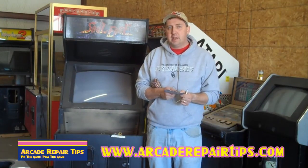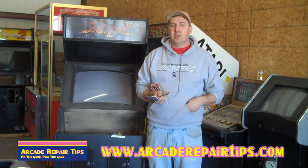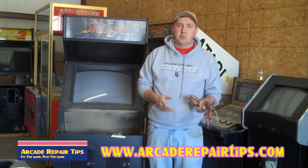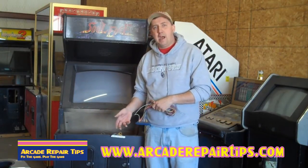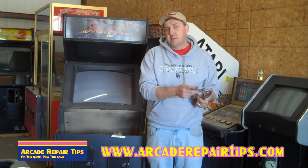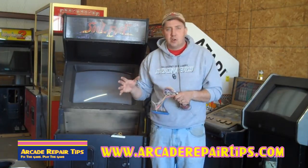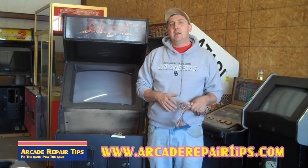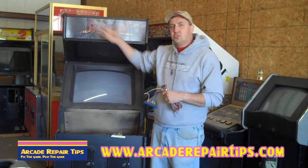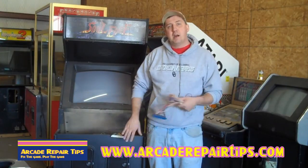You don't want to go plugging just any board into any game. Around '85 or '86, all the game boards were proprietary — if my Pac-Man board died, I couldn't test it in my Galaga cabinet without changing some of the pins. So what they did was come up with a standard: let's make all games a certain pinout. That way, without having to buy a new game, you can just trade out the marquee and the board, and voila — another game without having to buy a new cabinet.